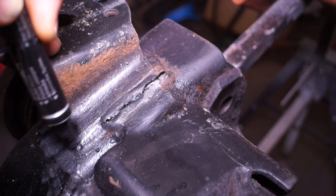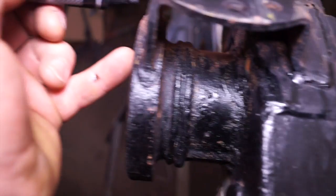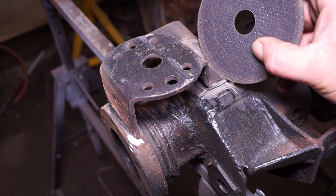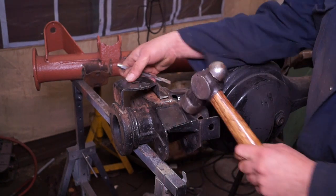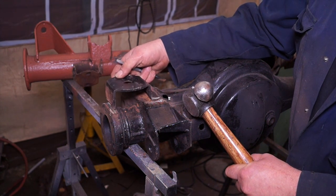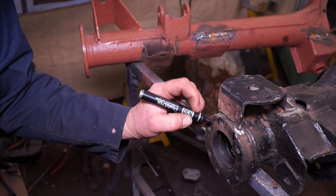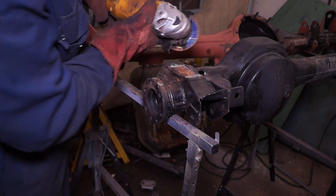You need to be able to cut the welds off — I'm marking them here: there are three welds on this side, and on the other side you cut the bracket along here. Cutting the welds is straightforward: cut downwards and then across at roughly 45 degrees to take out the weld, then the same on the next one — straight across and cut through the weld, then knock it off with a chisel. It should come off easily if you've cut the weld. This leaves the rest of the metal in place; it doesn't matter if you damage it slightly because you're welding back in that area anyway. The angle grinder disc is about 1mm thick to cut the welds, and you'll find the bracket is exactly the same size, so it's a matter of marking where the part will sit and cleaning up the area.